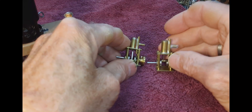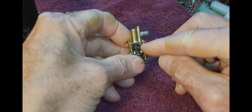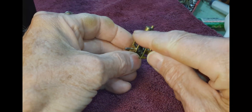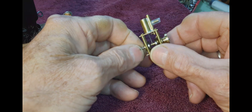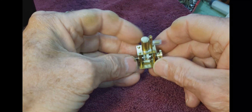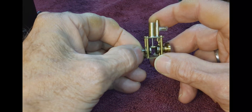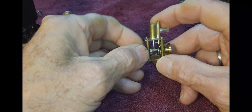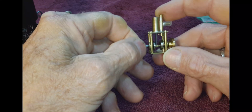As you can see, it's made mostly of brass — brass rod, free cutting brass rod. The cylinder and the valve tube are K&S hobby tubing. The crankshaft is made out of drill rod. It's a composite part that's silver soldered together. It's very strong.